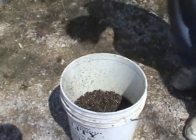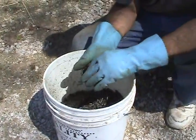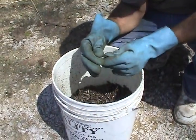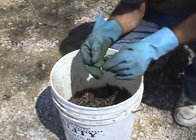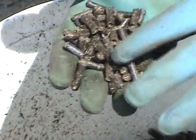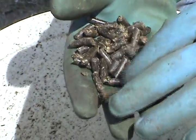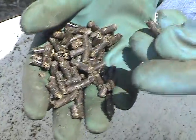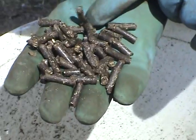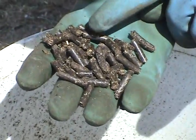This is what you're going to be looking for — not just the hardness of a pellet, because hardness is very important, but if you can get this glossy look right here. Don't even worry about the breaking apart because they're going to break apart. Let me zoom in a little bit and show a handful of those. This is probably the best pellet I've gotten out of this thing so far. That's from feeding it very slow. What I'm looking for all this time is this gloss right here — if it's glossy, I'll guarantee you it's going to be ready.